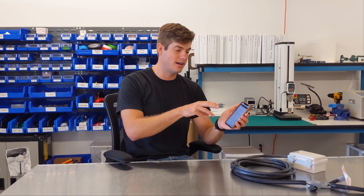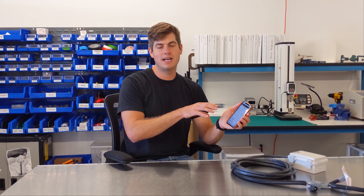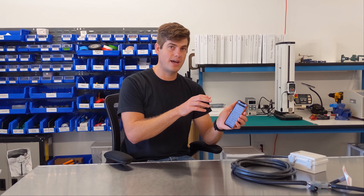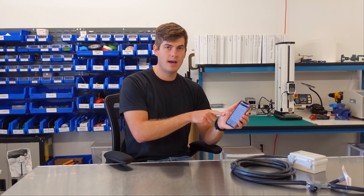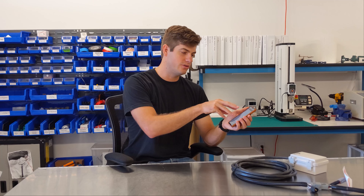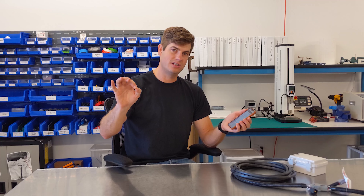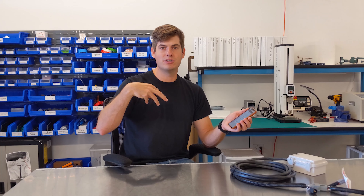To verify that, you're actually going to have to run the wind machine, which we recommend doing before frost night. If no one is at the machine you can do that remotely by changing your start and stop temperature. But safety first — we always recommend that if you're at the machine, change it through the app to make sure our device can tell the wind machine to turn on, and then when it does turn on we can measure that it's on.